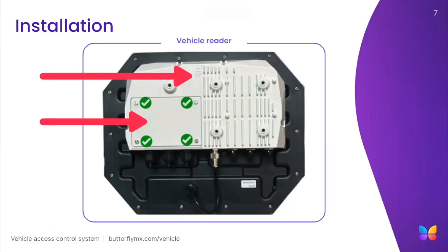Now let's get into the installation. Included in the packaging are the ButterflyMX vehicle reader and the 24VDC power supply. Upon unboxing the device, you want to identify the appropriate orientation for mounting. On the back of the device, find the word UP, which indicates which side of the reader should be positioned on top when mounted. Then proceed by removing the white square access hatch on the back of the reader by unscrewing the four captive screws. Keep in mind that you should not remove the caps of unused cable glands, caps from unused RF connectors, or any screws near the red check marks, as these will disconnect the RFID antenna from the device.